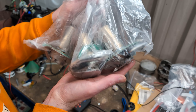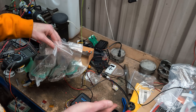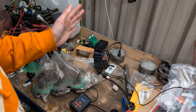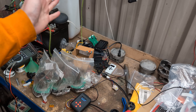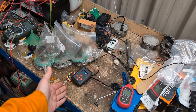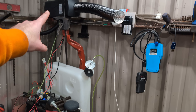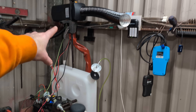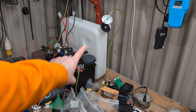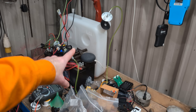I have purchased three spare 2kW burn chambers. There's a brand new one obviously in the heater just now — it's only ever run on diesel. My setup is we have the afterburner that's going to do the controlling, so it's easy to change the settings for the tune. I've got my little 2kW here, and we've got our fuel tank which currently has a little drop of diesel in it, which I will empty out and replace with the waste oil.